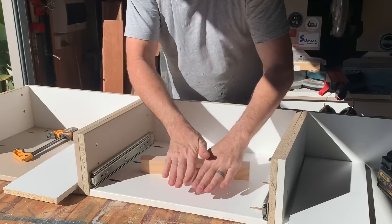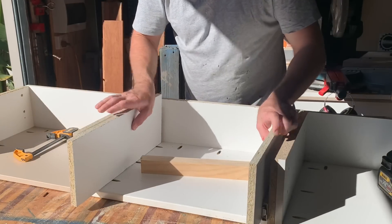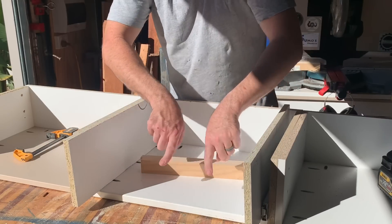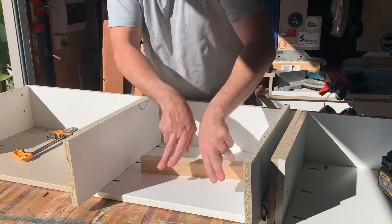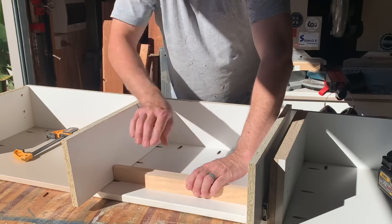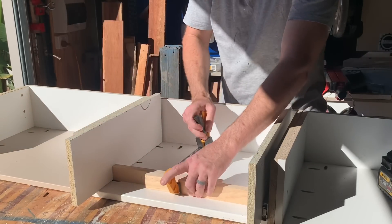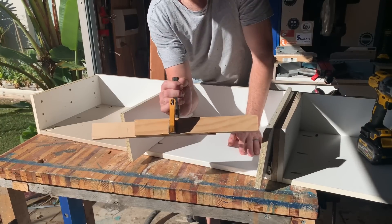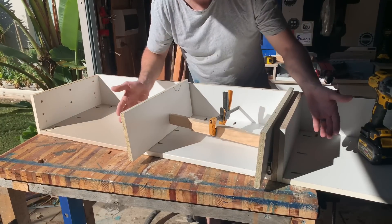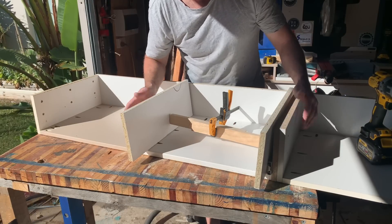I've got to figure out the width of my drawers. I've got the drawer slides in, and I'll have the two side panels. Now, there is an expensive tool that'll help you measure this accurately, or you can just get yourself two scraps of wood, slide them in, put a clamp on, and there is your distance to take over to the table saw. I'm going to check all my drawers, because there's a good chance they might be slightly different.